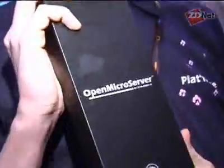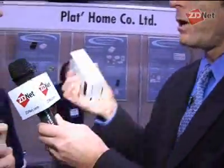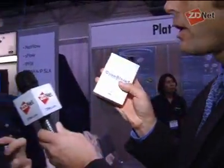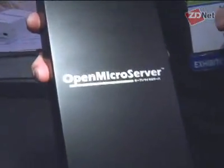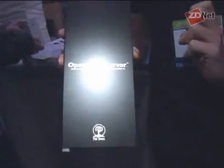This is the new model. It runs a 400 megahertz CPU, and we've added gigabit Ethernet, so it's suited for faster networks. It's called the Open Microserver, and it also has Power over Ethernet functionality to reduce your cables. So you don't need a separate charger or plug. The other model doesn't have that capability yet. The main differences between the two are the Power over Ethernet support and the port speed — this one has gigabit Ethernet, the other has 100 megabit.